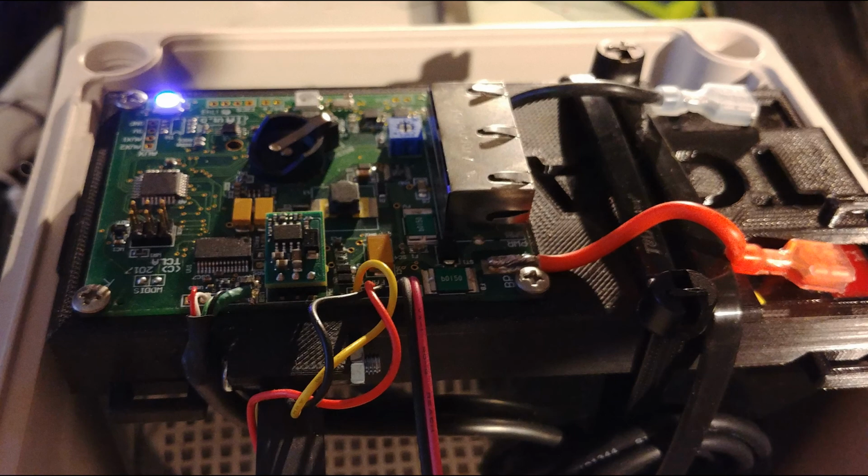Further, the system management unit has several sensors on board measuring temperature, humidity, etc. inside, from which it can decide whether to turn the Linux machine on or off and whether to turn the fan on in extreme hot situations. Further, it has a real-time clock and 3 levels of watchdog timers that will make sure that the instrument keeps on running, if necessary, taking the power away from the Linux machine and reapplying it after a pause.